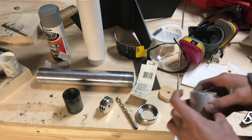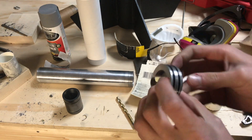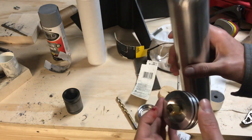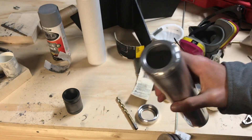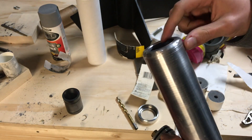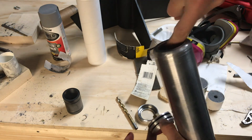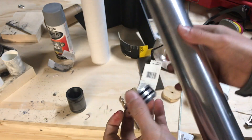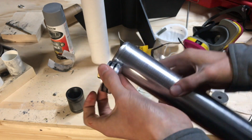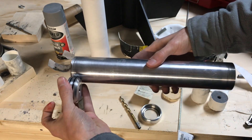So the way this is all going to go together when we fire it: this is the new bulkhead which I don't think I've shown yet — I just recently machined it. What normally happens when you have a fully loaded motor is the bulkhead slides up, and there's this ring that I welded in the top of the engine, undercut like that. The bulkhead slides up and rests against it — that's what holds it in place. The sealing is done by the two O-rings, and obviously the nozzle goes on the other end.